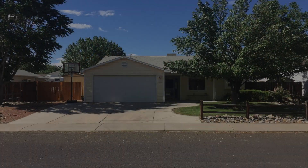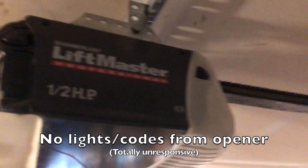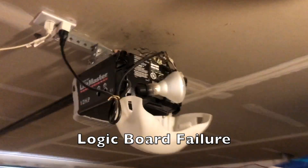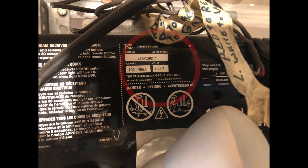The little wall button is flashing a green light and the garage door opener won't work. Tried resetting the lock and that's not doing anything. I searched online to find out what the flashing light means. A lot of results give you codes — things like the lock button being on — but if you only get this quick flashing, somebody suggested it's the logic board. Turns out that is the problem. These boards are about $150 new, even for an old opener like this 2007 unit, but I found one on eBay for about $45.